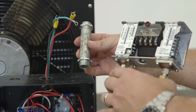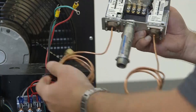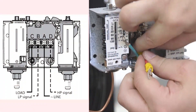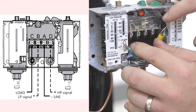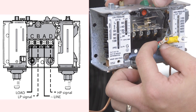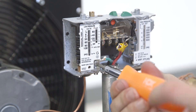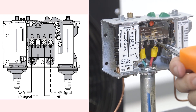The installation is similar to the way we removed the old switch. Inside the switch you'll see four different screws — C, B, A, and D on the contact system. Line is installed on A, and load is leaving on C. Contacts B and D may be used for an auxiliary function such as a light or alarm. Attach the ground wire, then fasten the screw. Next, connect the line and load wires at terminal A and terminal C respectively.